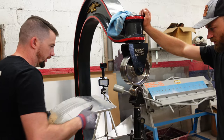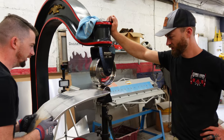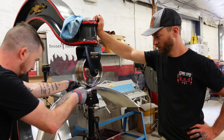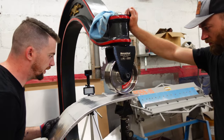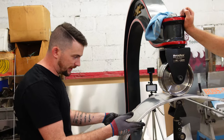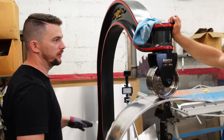One thing you can do if you fall out without having to do that. That makes sense. Use the momentum of the wheel. It's very easy to fall off the back side of the panel. Right. And that's another thing too. When you're metal shaping and using the English wheel, you do something called framing the panel like I did earlier, you make a frame. If you wheel outside that frame, you actually lose the tension of the panel. It'll flatten itself back out.